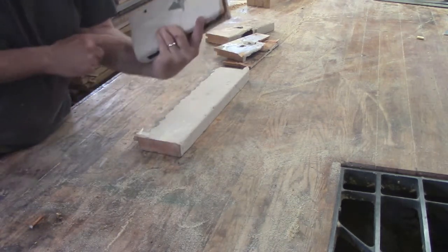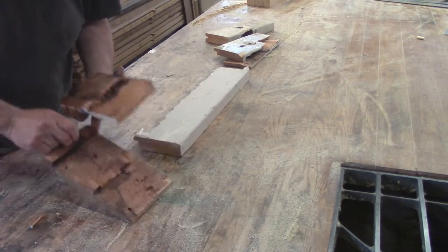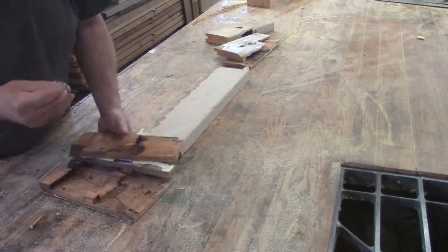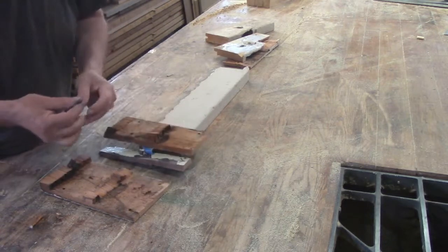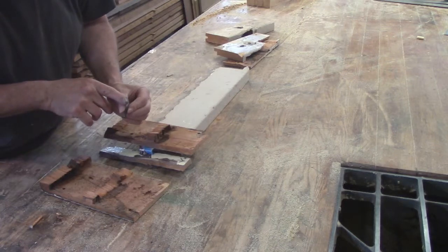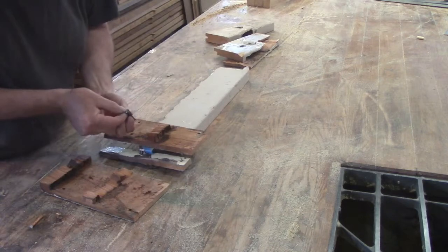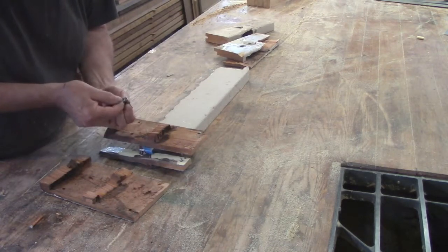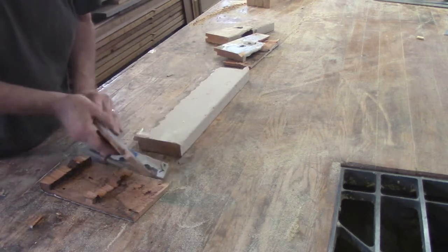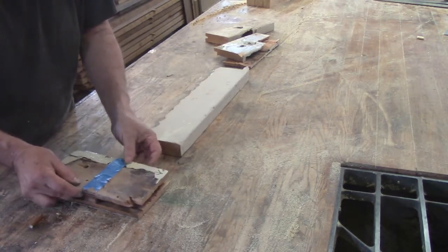We'll see it in just a second. It's underneath here. I've never taken it out. It's right there. You can see the stub of the screw. Now these are handmade screws. They're hand-cut screws. If you notice, in typical early 19th century fashion, they don't have a point, a little pig's tail, a gimlet point, and the slot in them is really off center and hand cut. These are handmade screws that they used to hold the bottom of this stile of the door together.